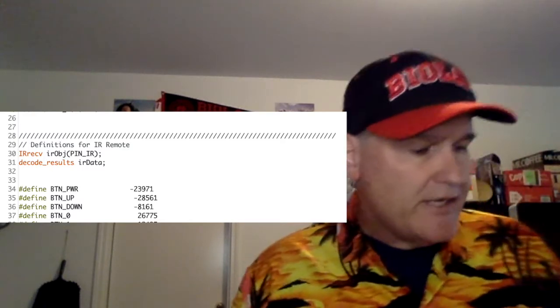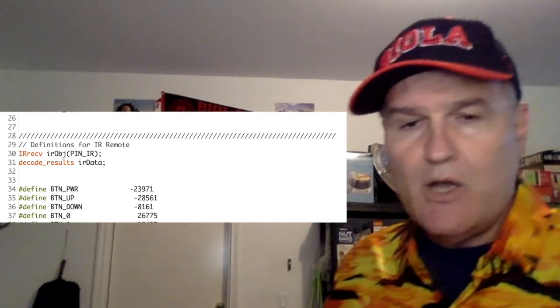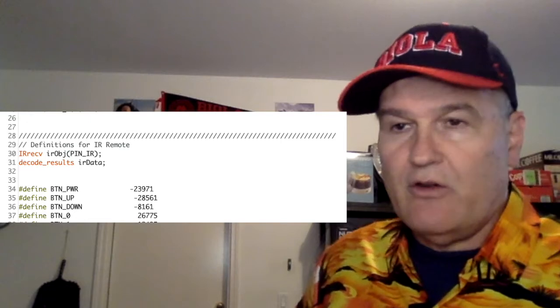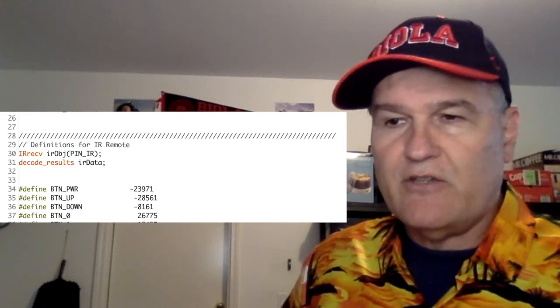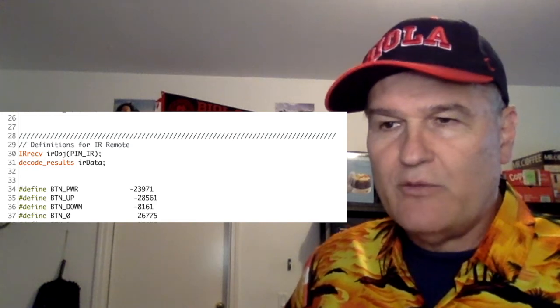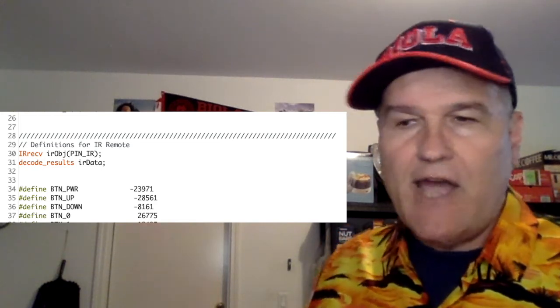What we learned in the lecture on the IR remote, lecture 13, is that you'd think the zero would return a zero. It doesn't. It returns 26,775. The power button returns a minus 23,971. I don't know what's up with that.